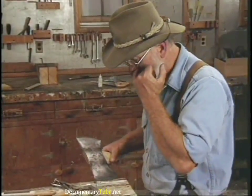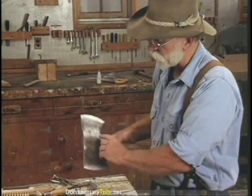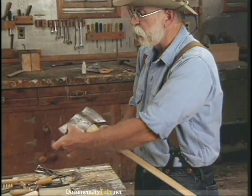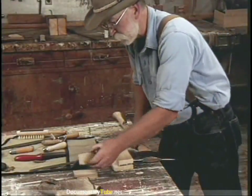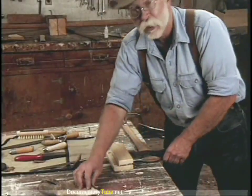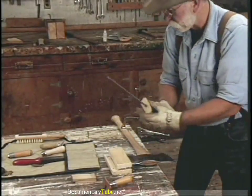The way I always tell at a glance what my good cutting edge is — I put the trade name True Temper facing me. If you're chopping right-handed, you hold the axe with your left hand at the handle and your right hand here. If you're standing like this and you can read True Temper on it, then this is your good chopping edge. Let's put it in the little vise, get it good and tight. I take a little wedge and run it underneath to raise the edge up and give it support when filing. For safety, always through this whole process wear both gloves and have the protectors on the files.